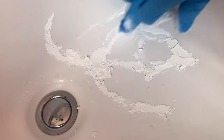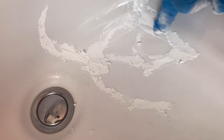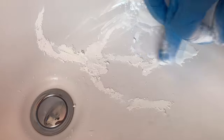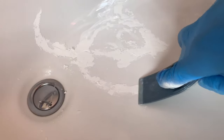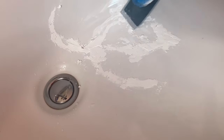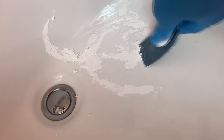After I smooth it out and it's nice and filled in, I can just wet it a little bit and smooth it out before it dries. This stuff takes about 24 hours to fully dry rock hard. You can see I'm trying to fill in the hairline cracks and it's just not going to work — which is fine, because I can scrape it off while it's still wet.